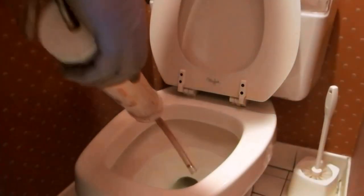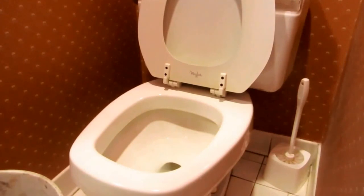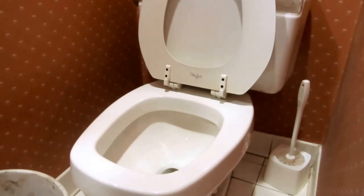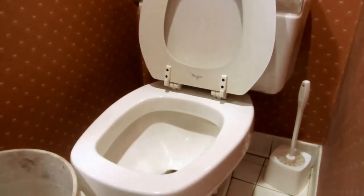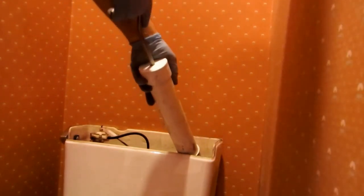I got my little pump here — I'll pump it into the bucket. I'm going to get all the water out of the system because if not, it's going to freeze and split. That's the secret to winterizing the house. I'm not worried about that top over there because that's going to evaporate by the time it gets cold anyway. So I'm not too worried about the water in the tank — there's nothing in there anyway.